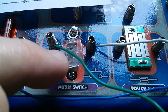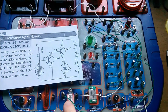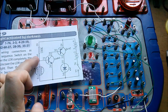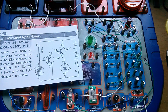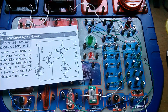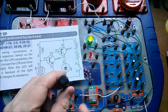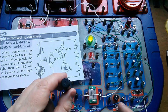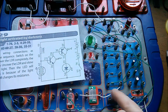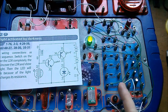I've just connected it across the push switch, because the push switch won't actually do anything. If I press the push switch now, it's probably not doing harm — it'll just be shorting the base of this NPN transistor to ground, which just reinforces the off state of the LED. I need to make this a high resistance by covering it up, and yes, that turns the light on. So the LDR kind of works the same as the photodiode. I might as well go back to the photodiode, because it's easier to cover the light — it's got a little black shroud around it.